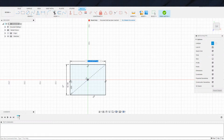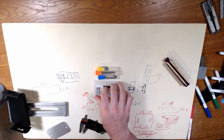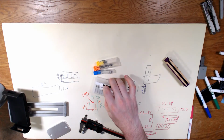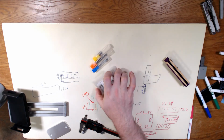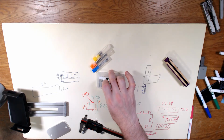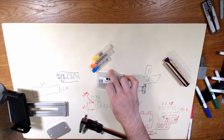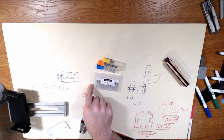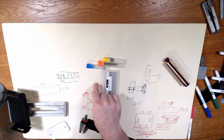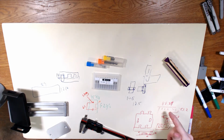Okay, actually, let's come back to the camera. I know I'm bouncing back and forth again. It just occurred to me, these individual bits, this container, let's say, right? It actually doesn't need to slide in like this. It can slide in like this into the side. So, that being the case, we really do only need the 53.2 on this side as opposed to the 88.3 on this side. Ish, rounding. Again, rounding numbers.